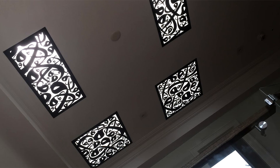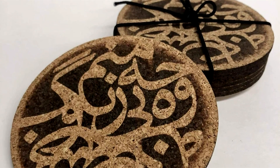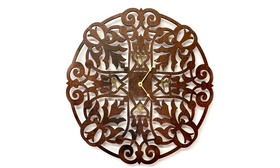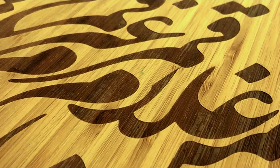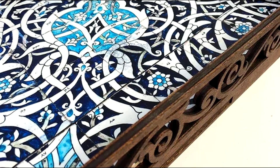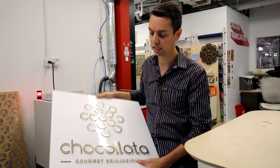There are designs and patterns with details that can only be achieved by laser — there's no other way. The moment you go to a CNC, no matter how small a bit you use, you're going to have a radius. It's a tool that's cutting, not a light beam. The level of detail you get with a laser machine is the only way. If bed size is not an issue, between a same-size laser or same-size CNC, I would definitely go with the laser for signage, gift items, and prototyping — it's more versatile, more accurate, and simpler to work with.